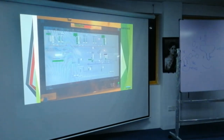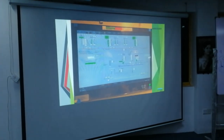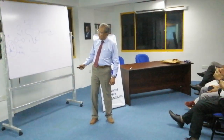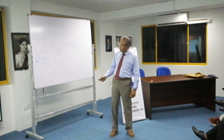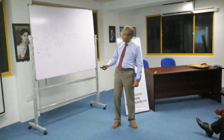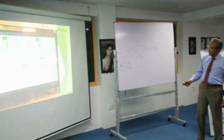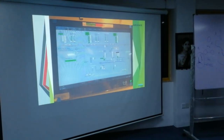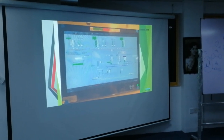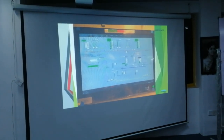And these are the two generators, and this is the harbor generator, right? So this is harbor mode. Now you see harbor mode, you have only battery. This one is feeding here to the propeller, and only the generators run. So power is fed from the AC bus to the DC bus, and it's also charging the batteries, and it can run with this battery power. It will run the shaft generator. This will run as a motor, and then can turn the propeller if you put this clutch on.